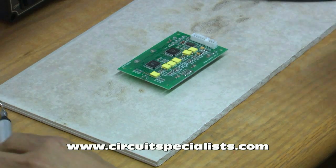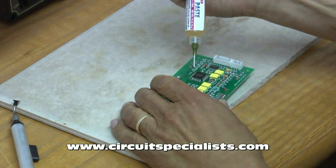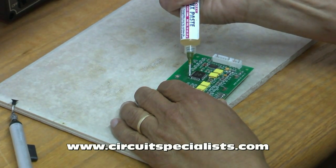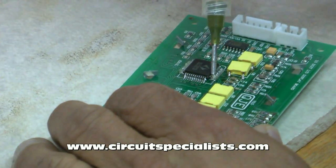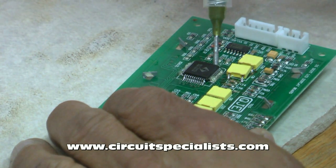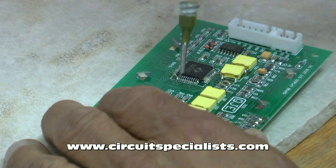While the air is warming up, the first thing I have to do is apply flux. I like to use paste flux — I'll apply just a very narrow bead all around the leads on the part I'm removing. I like paste flux because it's easier to use and doesn't get all over the place, but you can use liquid flux if you prefer.